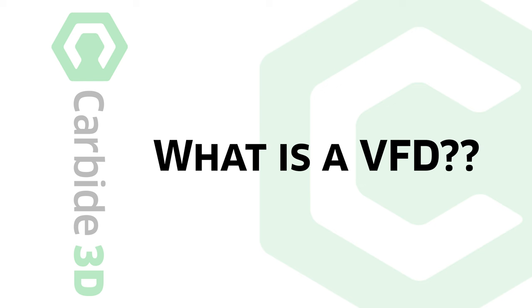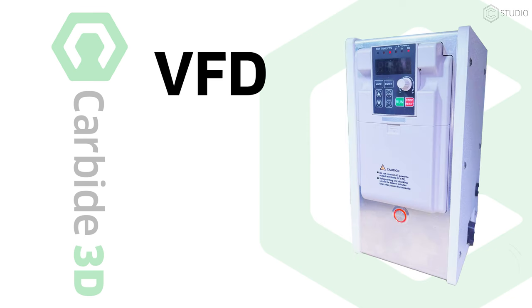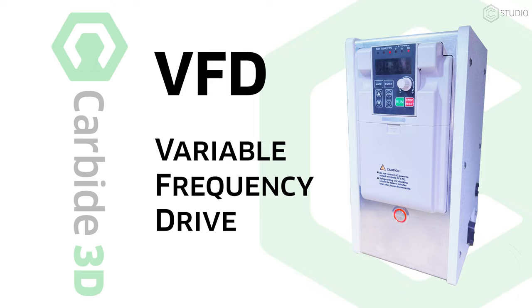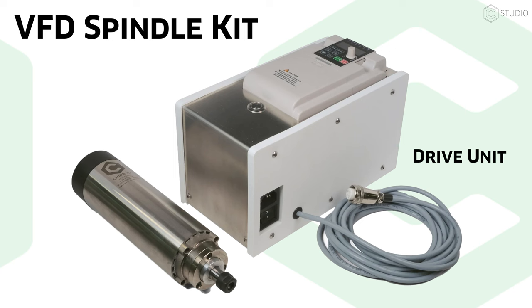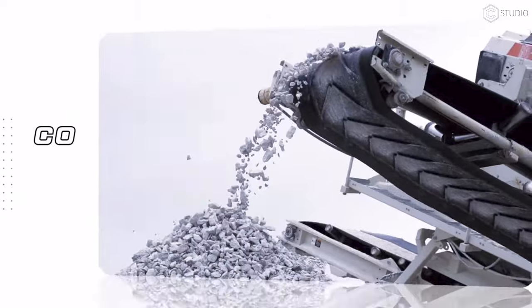Kevin Barnett back in the Carbide 3D studio. You might wonder right off the bat: what is a VFD? When looking at a VFD for your CNC machine, you'll see a lot of pictures of spindles — the business end of the system. The common name VFD refers to the controller — the Variable Frequency Drive. These controllers are used in a variety of industries to control AC motors, adjusting input frequency and voltage to control speed and torque. The drive unit also provides overload protection, stop and start control, and adjustable acceleration and deceleration. Controlling the speed of an AC motor is useful across many industries, from golf carts to conveyor belts and certainly CNC machines.